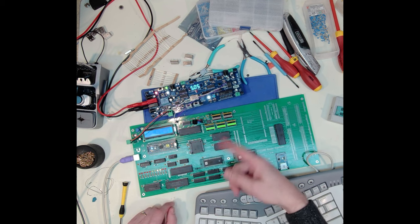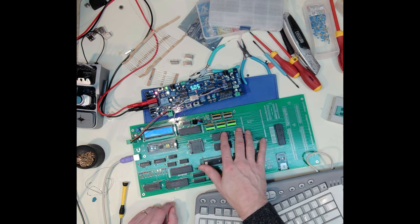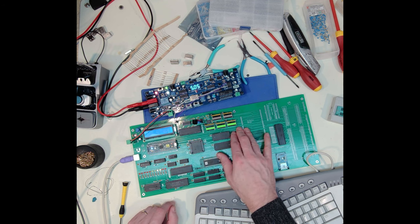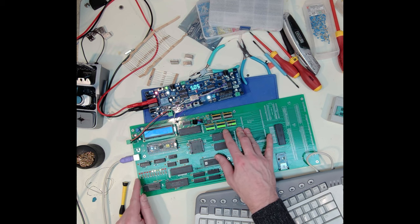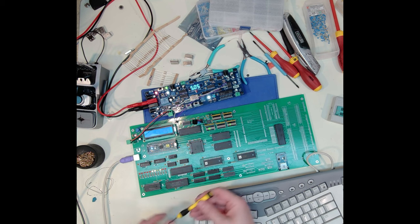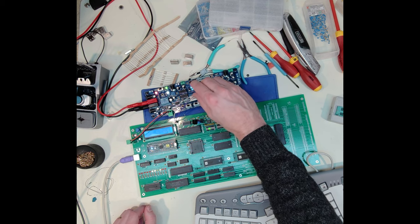So right now it's going through its internal processor reset. I'm getting all F's on the address. And then once it gets through, what was it, 40 cycles, now it's starting to go through and read from my ROM. And then I'll see that it's going to move on and read and write to RAM, and it's going to use my PPI as it gets going here. And that's pretty slow, so I'm just going to pick up the pace of that a little bit.